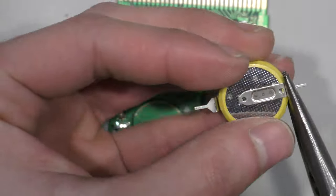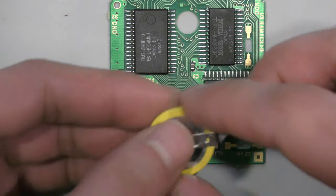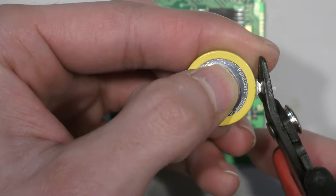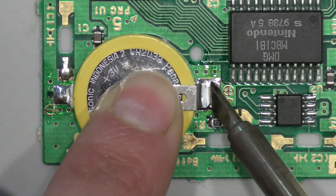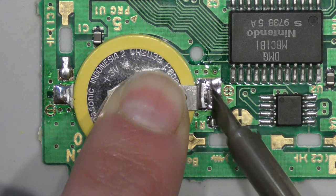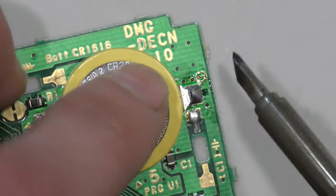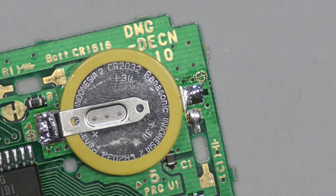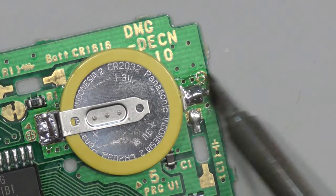I'm going to adjust and clip these pins a little bit just so they can fit on the pads. Now since this battery is a bit thicker it's going to sit taller on the PCB. You want to make sure it's as flush to the board as possible — you can't have it up even half a millimeter. It has to be pinned to the board as close as possible, just so the top sleeve of the cartridge can slip over and close in conjunction with the bottom half. If it's sticking up half a millimeter, it's not going to close.